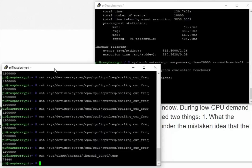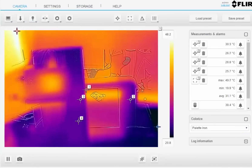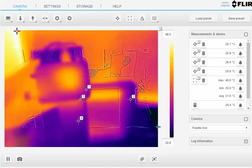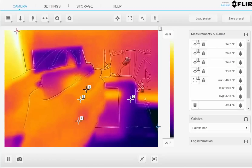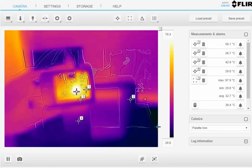And if I look at the temperature that it thinks it is at — you can see it's now running at about 73 degrees centigrade. This has been doing this for about 10 or 15 minutes, so it is starting to get quite warm. I'm running this thing quite heavily using the prime number calculator with 32 threads. So I've got the Pi back up in front of the thermal imager. Let's just take the cover off and we'll see how hot this thing is getting now.